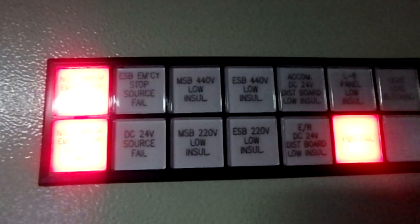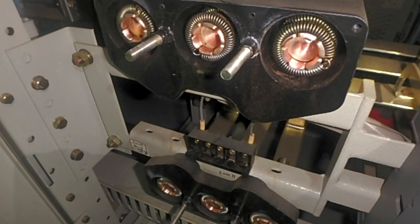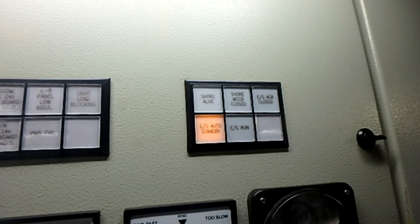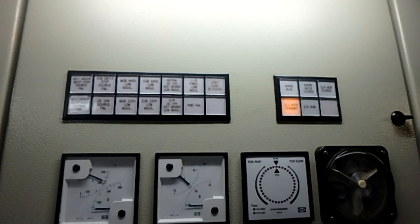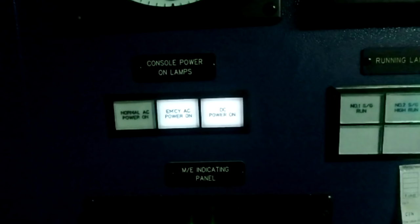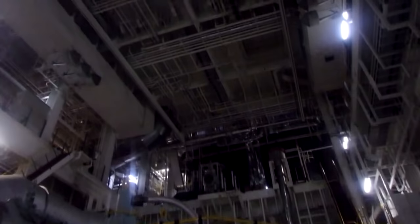Next, after we have increased the speed, and when the main power is restored at the beginning, when we start the first generator, our emergency generator will be disconnected from the emergency supply line, and the switches will change position. The emergency switchboard will be disconnected and the main line will supply it.